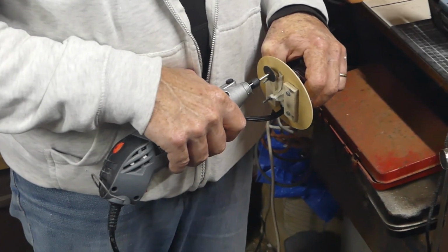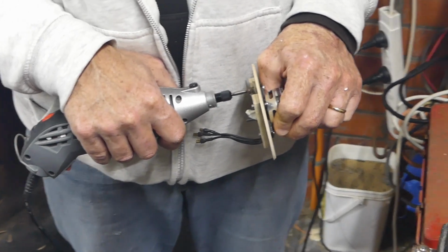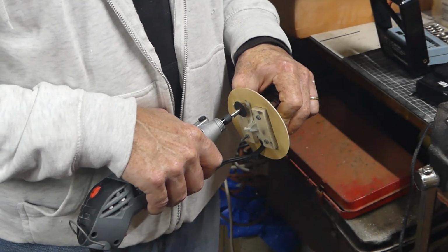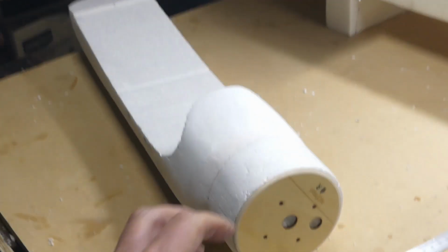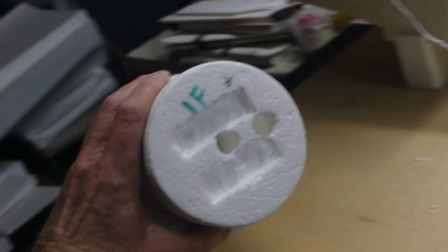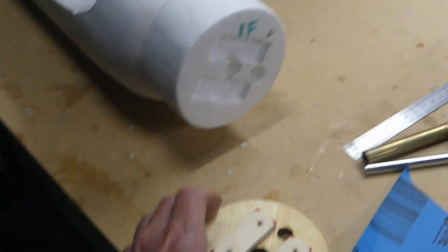We're cutting off the attachment bolts for the electric motor from the plywood firewall. You can see we've added some wooden reinforcing behind, and they are going to attach like so to the nacelles. You see that we've put some recesses in there for the wood to go into, and the nacelles themselves are getting finished off. Got this nice sloping upward and rounded end of the nacelle that we didn't have before.